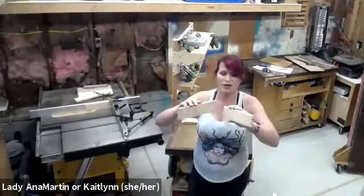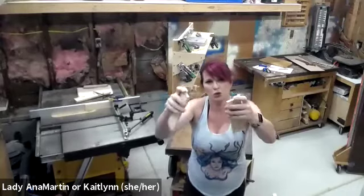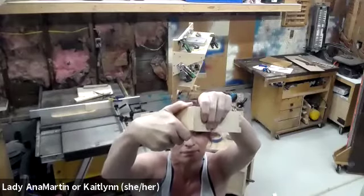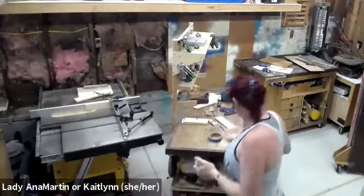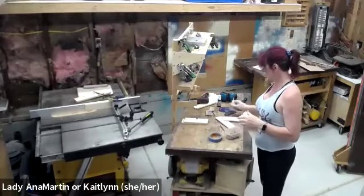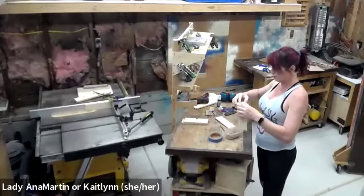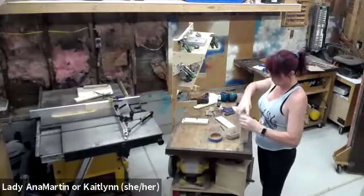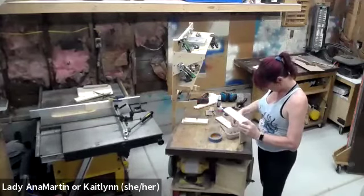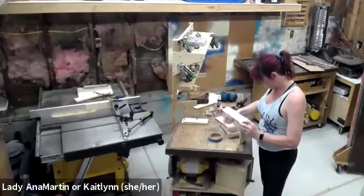So in this one, if we're going to use glue, and we should, the only face grain we have are these two little shoulders right here where they come together. And so I'll go ahead and put a dab of glue there because why not? Make sure I've got the insides on the inside. There we go. The little nails are at the bottom.